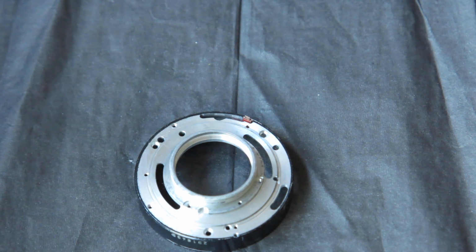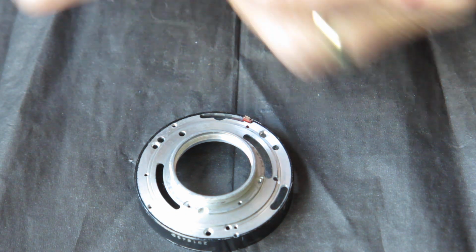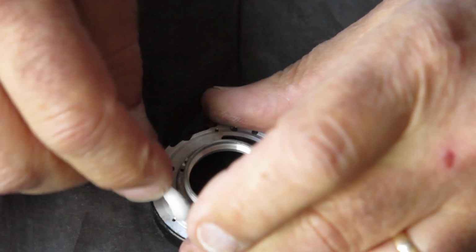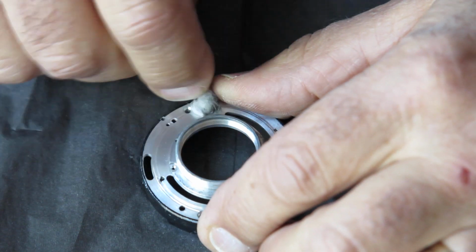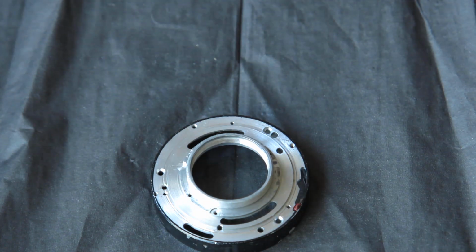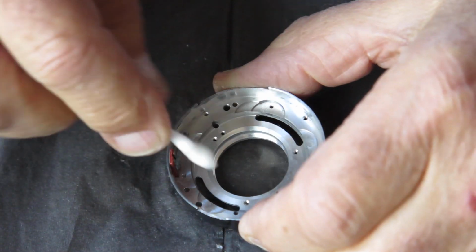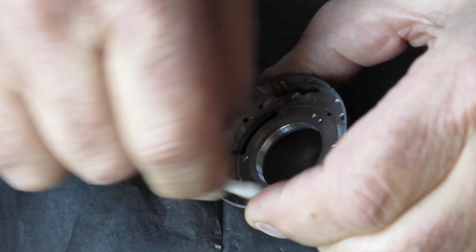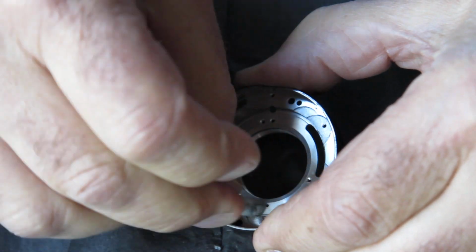Here I'm cleaning the shutter case. This is often the dirtiest part, of course, because it's on the outside. The oils usually percolate up from the focus helical at the back of this case. So this is often the oiliest part you're dealing with. Unless you strike something really strange, like shutters where some bright spark has opened the front, squirted some oil in order to fix their shutter problem, and ruined it.